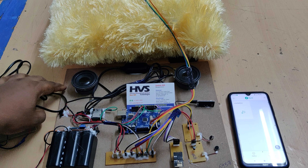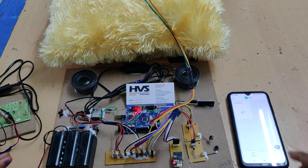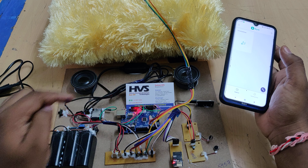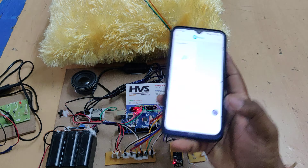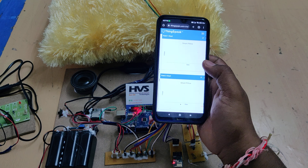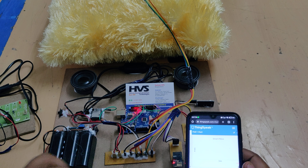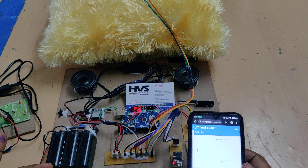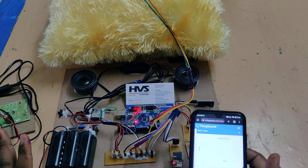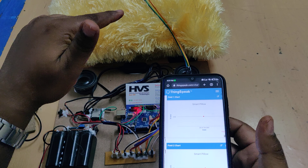With the hotspot on and power supply turned on, you can see the lights blinking on the Arduino. Stay on the ThingSpeak screen and wait until the first sample is uploaded — this confirms the system is stabilized. Initialization takes a maximum of 10 to 15 seconds, and we get the X, Y, Z sample from the sensor.